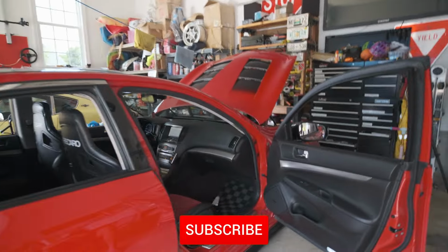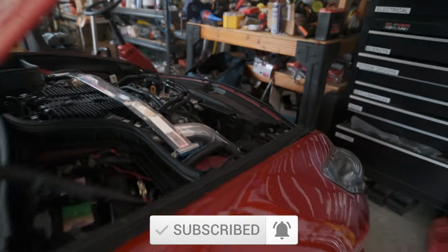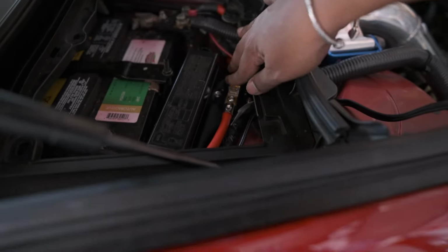Oh my goodness. The pump ran two cycles. This is not even hot. That is the best part. Please say no to copper clad aluminum. Whoever designed or came up with that, they need to be taken out back. Get pure copper, look on Amazon, make sure it's good, clean copper. Go to Tractor Supply, get some welding wire. Those things have to carry a lot of amps, so it has to be really good copper.